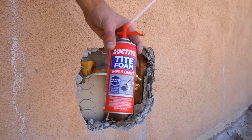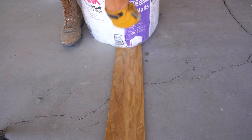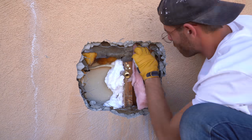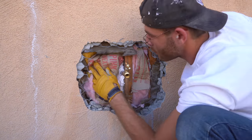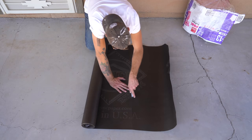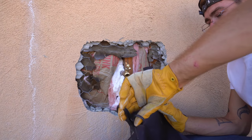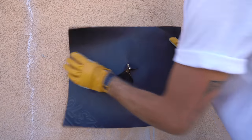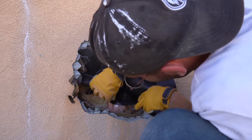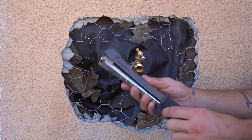Then I used a little bit of spray foam to help insulate the copper behind the wall. I also cut a small piece of batting insulation to replace what I pulled out earlier. There's a layer of waterproof paper behind your stucco called 60-minute or 10-minute building paper — it's about $15 for a roll. I cut a small piece and made sure to work it behind the existing paper so the water can shed like a shingle. You'll want to staple everything to 2x4 studs.